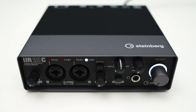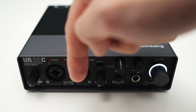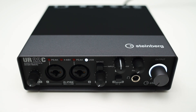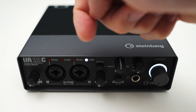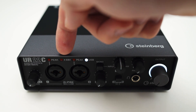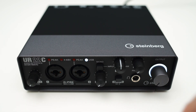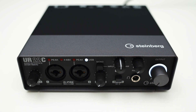On the front of the UR22C you can find the two gain knobs for the two audio inputs. These two inputs are XLR and TRS combo jacks. Above the inputs you can find four LEDs: two peak indicators which light up when the audio signal is clipping, one USB connection LED which turns on when the interface is connected to a PC, and another LED which indicates if the phantom power for the two XLR inputs is turned on or off. Next to the gain knob for channel 2 you also find a high Z button which lets you toggle the TRS input on channel 2 between a line level and instrument input, so you can directly connect an electric guitar to the interface. New on the UR22C is the mono button which lets you decide whether you want to monitor input 1 on the left and input 2 on the right, or listen to a mono mix of both inputs.